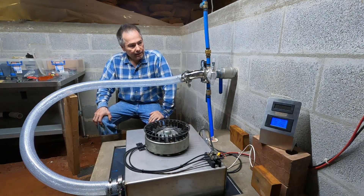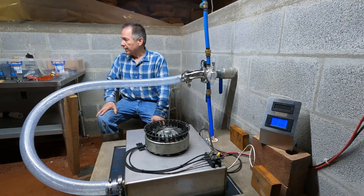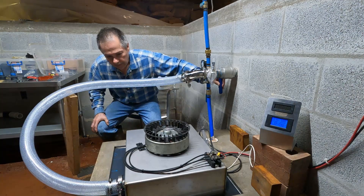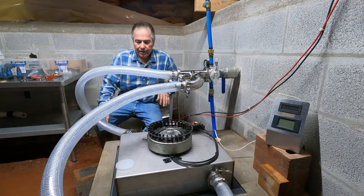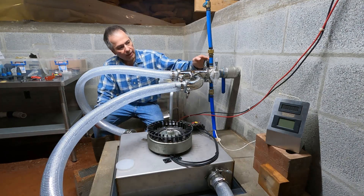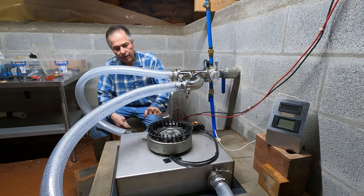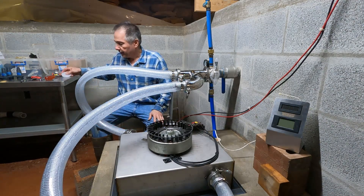There's no sense testing the other nozzle either — the dual nozzles, I don't think it's going to be enough. But we'll throw them on and see if the two 286 thousandths will do it. I'm going to swap to the other two nozzles so we have a point of reference. We have dual 287 thousandths jets, trying to get to about 42 psi. We'll see where we land. This is the 30-spoon Pelton, and we're running at 12 volts.